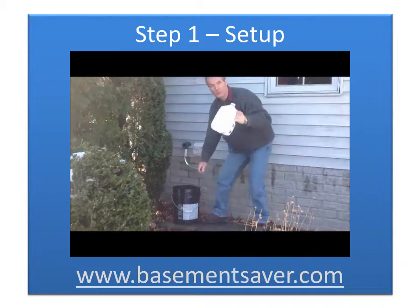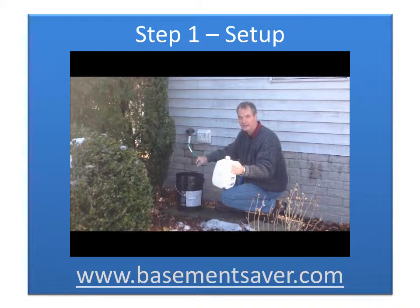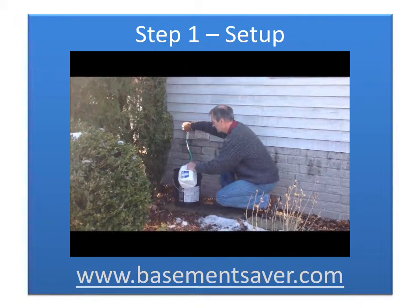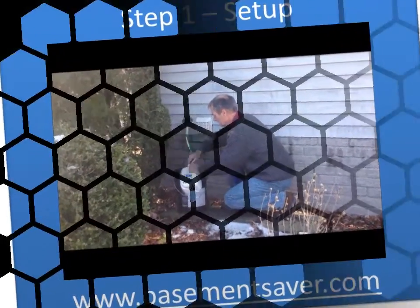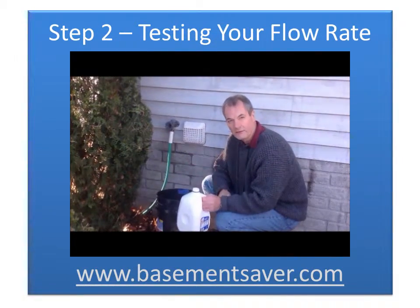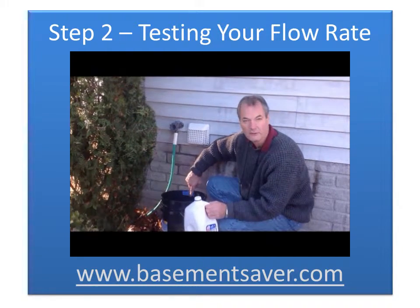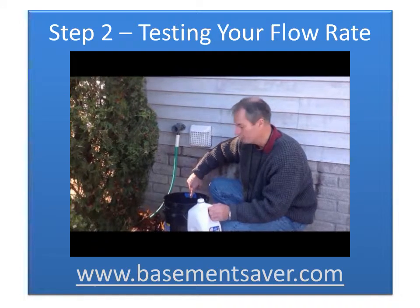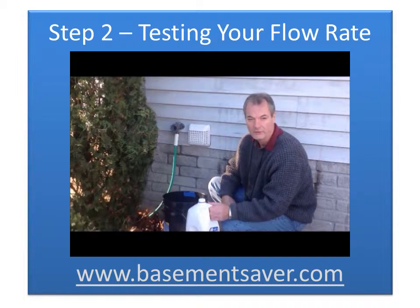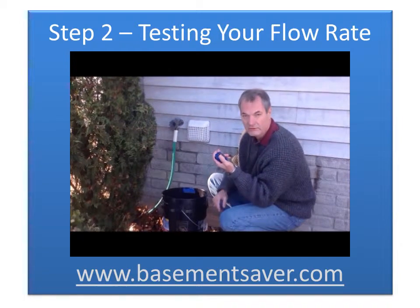The first thing we'll do is make sure we understand where the five-gallon mark is on this bucket. I'm going to use this one-gallon container and fill the bucket five times with it to get a mark on the bucket. I filled my one-gallon container up to the mark five times, poured it into the bucket, and I've marked off on the bucket exactly where the water line should be — this ground isn't level — and put some tape in place. Now I'm going to fill the bucket from the water supply and see how long it takes. I've got a stopwatch here to do that.